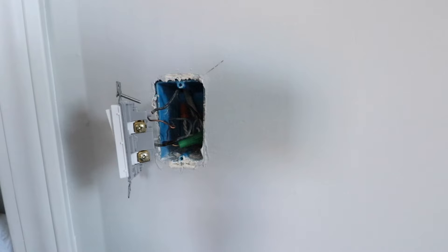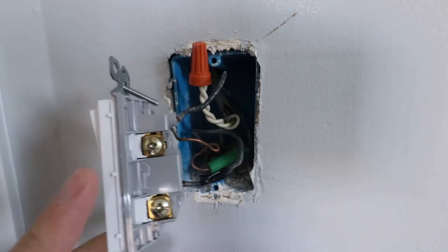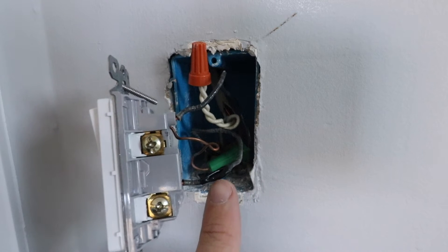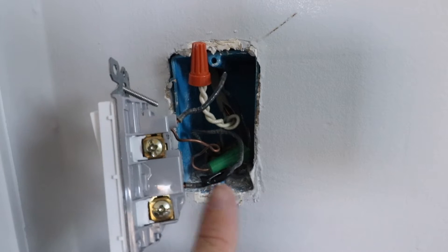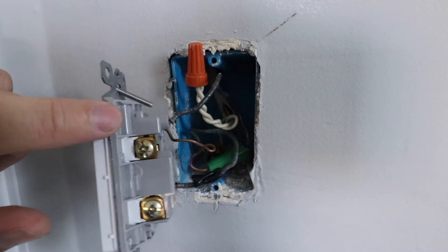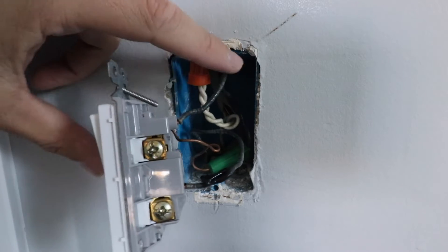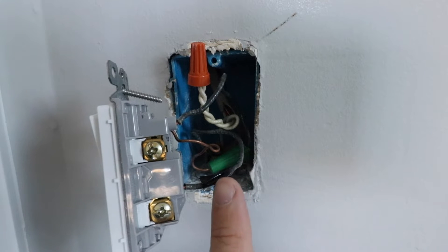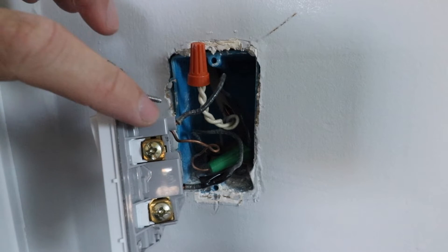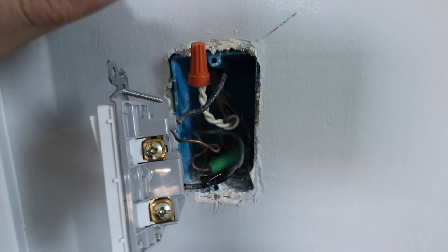Now that we've got this out here, let's take a closer look at the wiring. Before you do anything else, take a picture of your existing wiring. On your light switch on the bottom, the incoming wire should be your hot wire, also known as your line wire. If you don't have it marked yet, get a little piece of electrical tape and mark it so that you know which one is your hot wire. The wire coming out the top should be your load wire, and that is the wire that goes up to your light fixture. So the incoming line wire or hot wire at the bottom is the incoming power, and the outgoing electricity to the circuit goes through the switch via the load wire up to the light fixture.